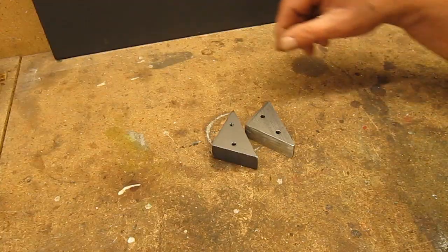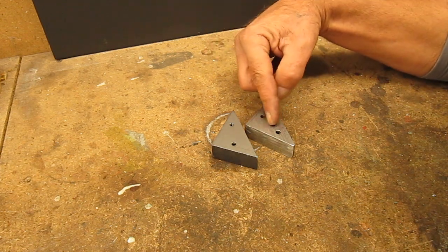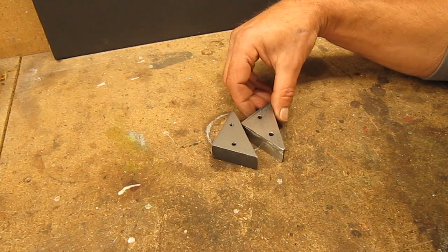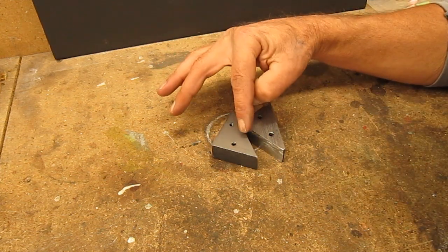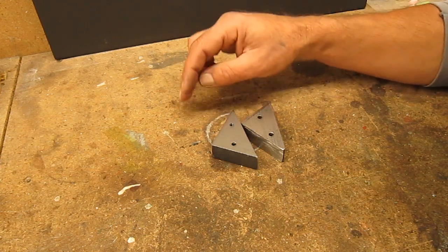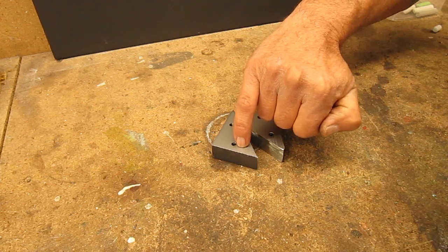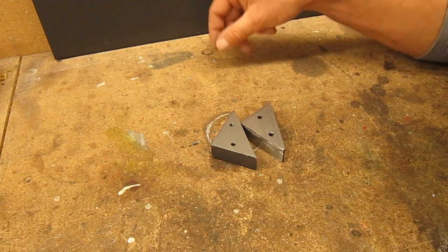You can see the difference in finish. This one is with the shear tool and it gives the impression the material was really ripped off. The other tool is a roughing tool and it cuts way better — the finish is way smoother. You have this line pattern in it, and of course the cut wasn't deep enough to take away these lines, but that's okay, it's not a problem.